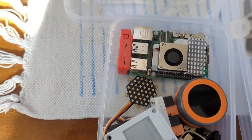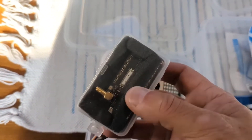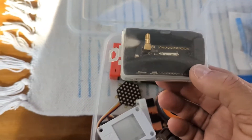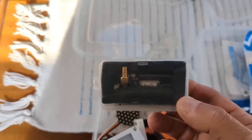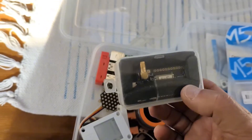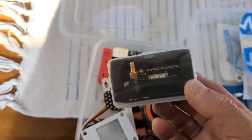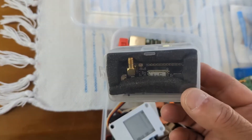I've also got this, which is a MeshTastic node. I'm looking at putting MeshTastic on my boat — it's going to broadcast out statistics like depth, anchor good or anchor bad. So if you're on shore, you can have one of these and it will alert your phone through MeshTastic, which can go several kilometers — open, license-free, long-distance, meshed wireless connectivity.